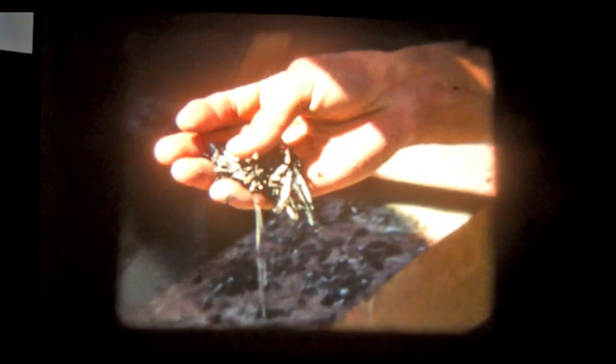We are back at the gearbox end, and these are aluminium chips shaved off of the coping wheel by the steel rope as it slipped in the drive slot. The hot Arizona sun has melted the grease, which is normally packed in the centre of the rope, making it unusually slippery. The solution: covering the rope with cement dust.